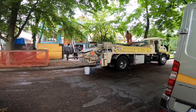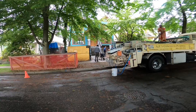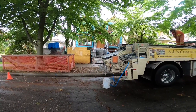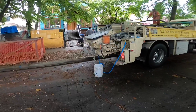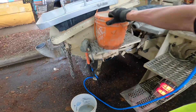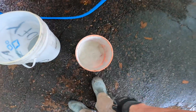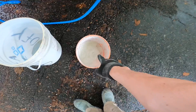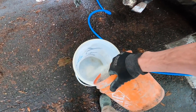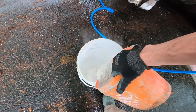Happy Saturday — doing a little stamped concrete today at a really cool, beautiful house with really fine detail work. What we're going to do here: start off and mix up some of our fancy-dancy powdered bentonite. I keep mine in a little tub like this; it's about $15 for a 50-pound sack. I'm going to put in about three measuring cups worth of powder.